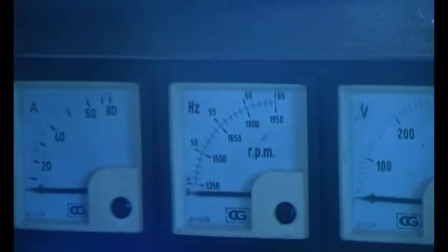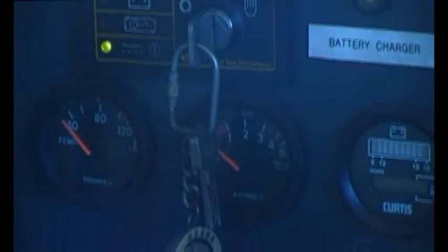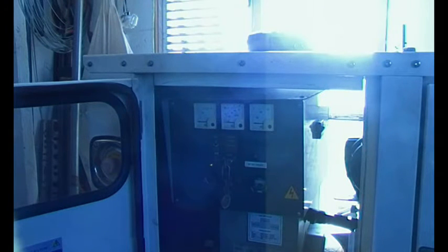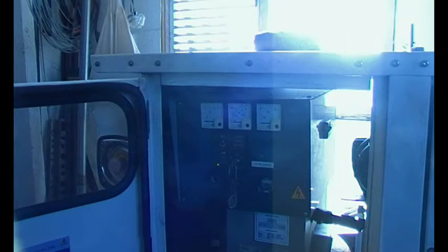Here's the control box. It runs for a short period automatically once a day. You could set this sort of thing up with a modern Victron inverter, which has quite a lot of relay outputs — effectively you've got a relay in there and you can wire to the contacts and feed 12 volts or 24 volts through the contact to switch something else. You can also have it on a time clock so it switches on at certain parts of the day.